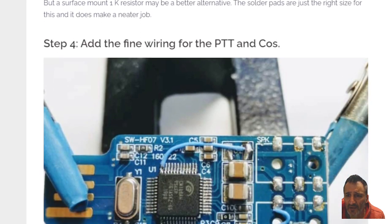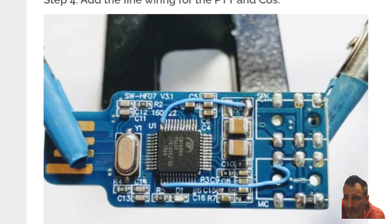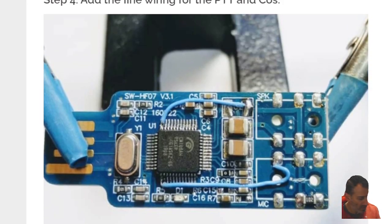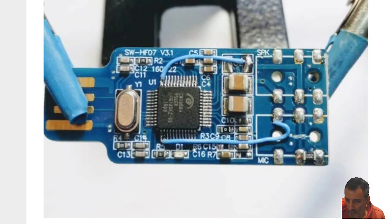Going down, add the fine wire for PTT and COS. You definitely need that, otherwise it won't PTT. So you've got the blue wire going to the very left one there. Going down, looking at my device, they've removed — see at the top here — you've got these two orangey brownie blocks right in the middle. I would say that they've removed the top one. You can see that the wire goes from the right hand side to the left there. Scrolling down, they've also removed at the bottom here a tiny one just to the left of the word Mike.